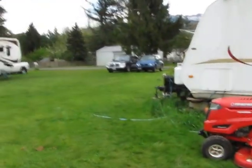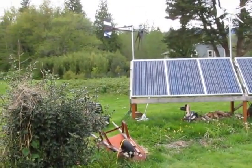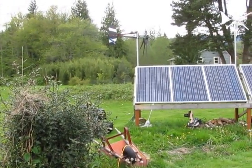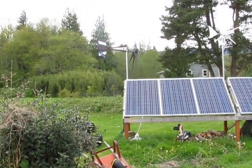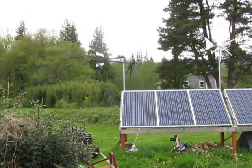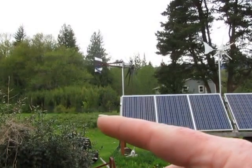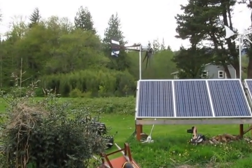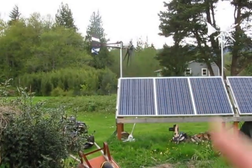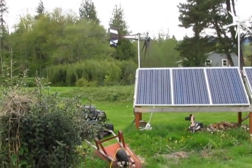There's a lot of stuff I'm going to be working on and some more videos I'm going to be doing when I start moving that turbine to his new home. I think I might just stay with the 11 blades generation fours — they look fine and seem to work just fine. I was a little worried they might not put out enough power, but I'm going to be running him as a 24 volt, and if I need to charge batteries I'll go through a Midnight Solar MPPT charge controller, and then I'll put my own dump load or diversion load when the batteries are full.